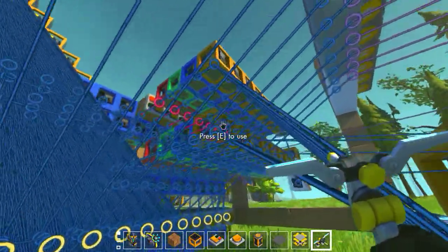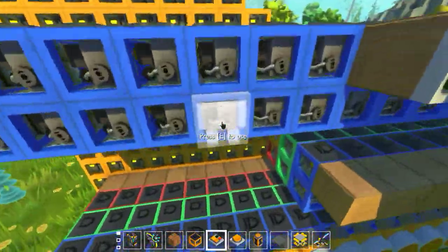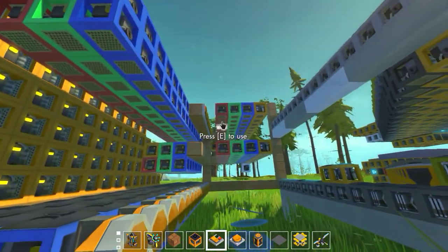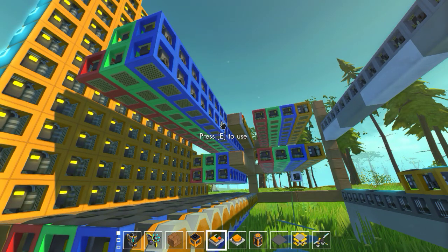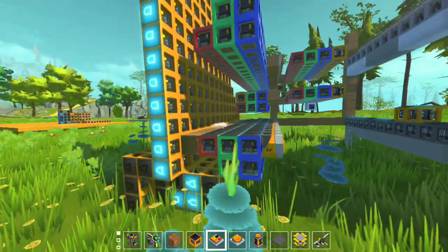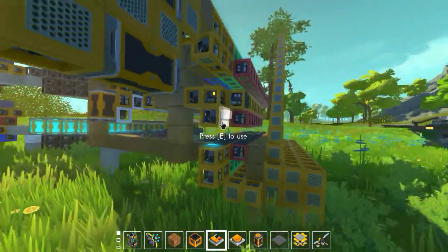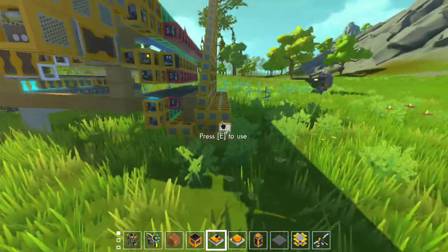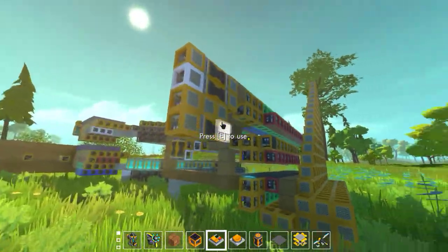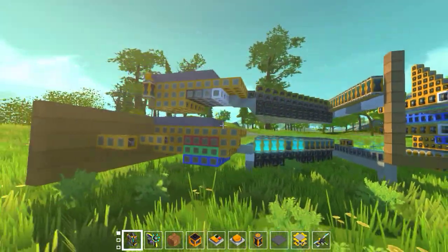So you can multiply two 8-bit numbers. It feeds the top number into a big shift register and the bottom number just gets saved right here. It adds and saves into a third register to multiply up, and it just does that 8 times as the top number shifts across to get the value.